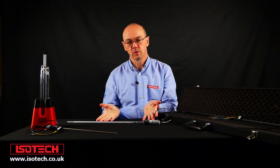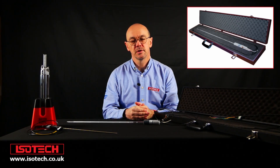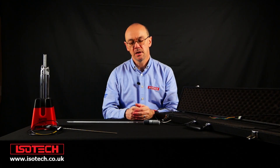So here we have a quartz-sheathed Standard Platinum Resistance Thermometer. This model can be used from minus 200 to 660 degrees C. With appropriate calibration, the uncertainty can be just a few thousandths of a degree C. And over narrow ranges close to 0, we can have uncertainties smaller than a thousandth of a degree C. The coil at the end here is very different.